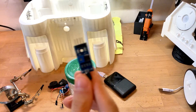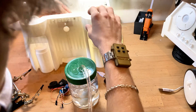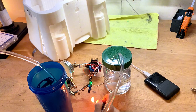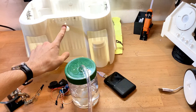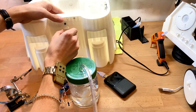Probably my favorite feature of Herbie is the fire extinguisher. The way his fire-extinguishing system works is with an infrared sensor. Once a flame is put in front of the sensor, it sends a signal to a motor controller board, which then tells a submersible water pump to pump water until the flame is gone. I added two holes in the front of Herbie — one for the nozzle for the water to shoot out, and one for the sensor to pick up the fire. Now all that's left is to test it out.